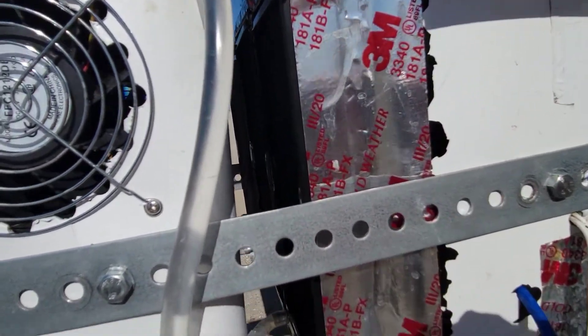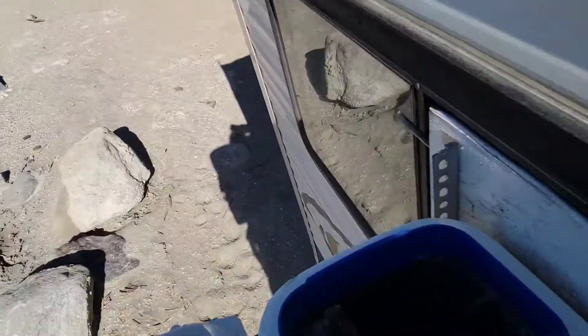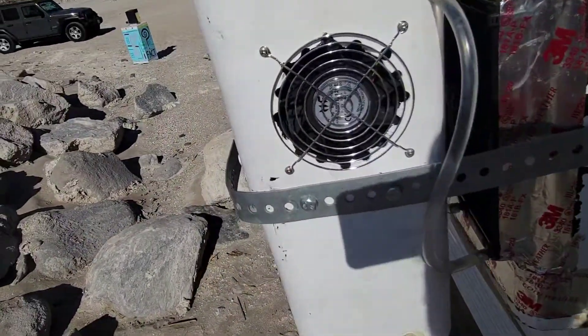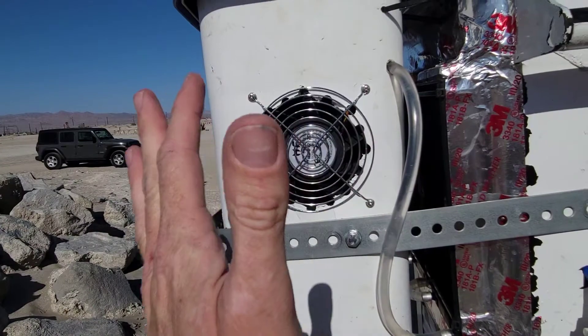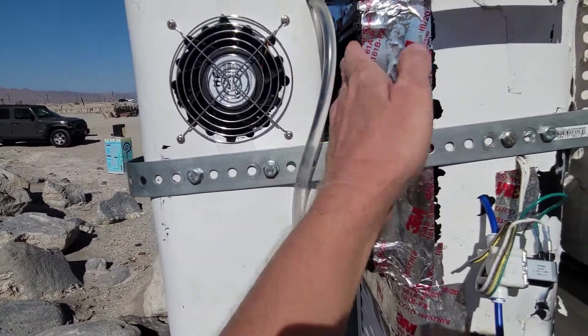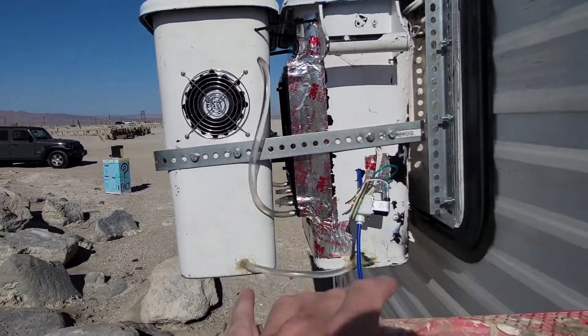Normally, people would use these to cool their CPU. I have the cooled water that will pump through them. And then I have another fan assembly here. Let's go up through a cooling pad there. What this does is exhaust the moist air. Because when you spray water through it and blow dry air through it, it moistens the air. And I don't want the humidity to increase. So that's why I put the chilled water through here, through the heat exchanger.